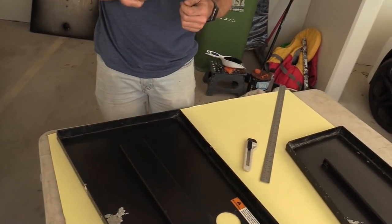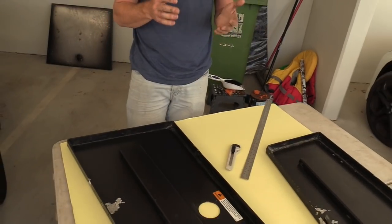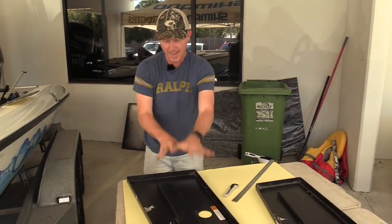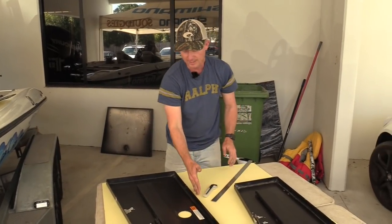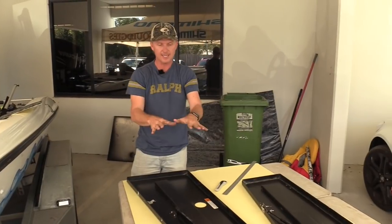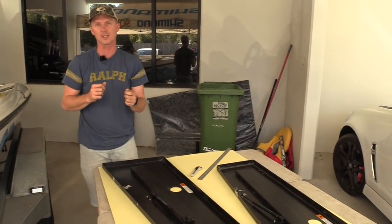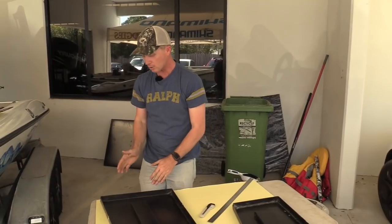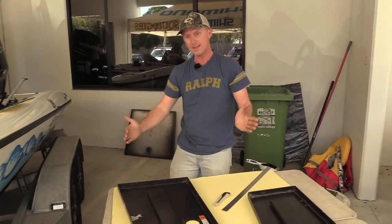The best way for me to work with diamond deck is the same as working with marine carpet — put the hatch on top, cut around it with an inch or two spare around the edge, pull the backing sheet off, stick it down, notch the corners out, and roll the diamond deck around. I've tried going flat across the top and cutting strips on the edge — Lego style I call it. It works well but doesn't look that good.